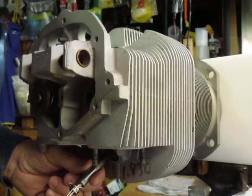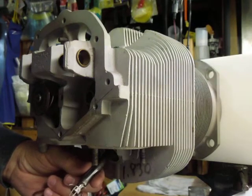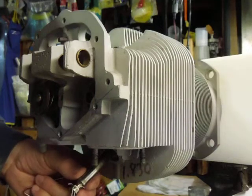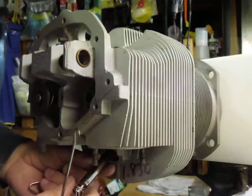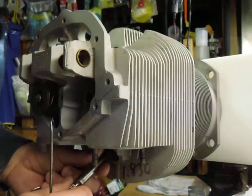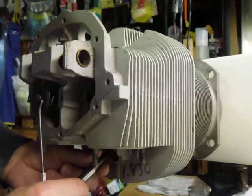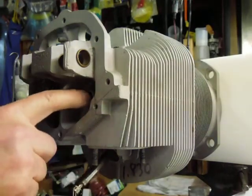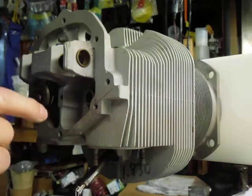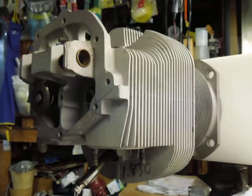Look down through the top hole, reach in there at the head of the valve, lift the stem, and that easy — stem's out. One thing I noticed: it made it easier if you have both pieces of string on the same side of the valve, because you can lift it up with a little bit more control. Once you get it here you've got access to the stem, so you can take — I think it's a scotch-brite as the service bulletin says — and buff off any deposits. Don't do anything that's going to change it dimensionally or put scratches in it. Also, look up in the overhaul manual which reamer it takes; you can ream out the guide and get it back to its normal size.